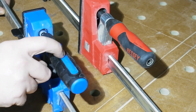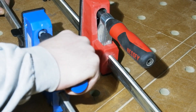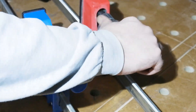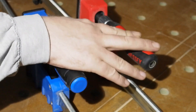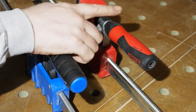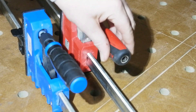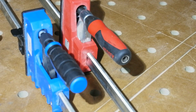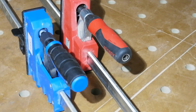The handles themselves are quite different. The Salta Body Clamp has a clearly budget handle — both the rubber over-mold and the plastic don't feel especially tactile or quality, but are amply sized for applying good clamping force. The Revo handle feels great — good ergonomic shape, a little longer, with extra rubber near the jaw end for the thumb, lending itself nicely to overall feel and feedback for the force you're applying. A pretty significant difference is that the Revo has an Allen slot in the back for adding extra clamping force, which likely explains the more hefty clamping lever. In use, this extra Allen-key force can be a blessing or a hindrance — in one instance it helped me close up a joint on a particularly awkward glue-up; on another it nearly ruined a small tabletop before I noticed the force was distorting the clamp and my work. I'd rather not have it there to tempt me.